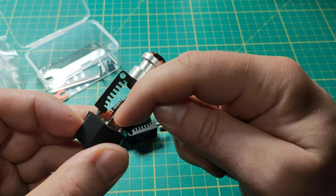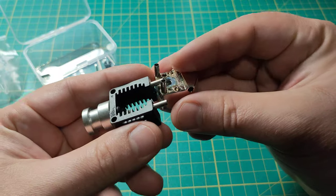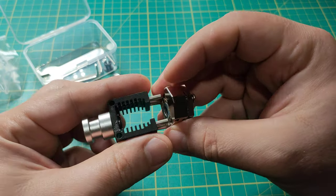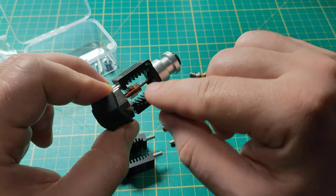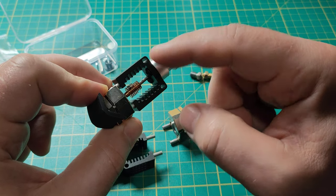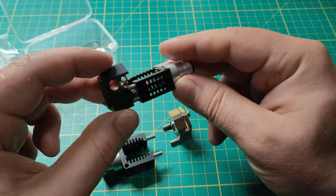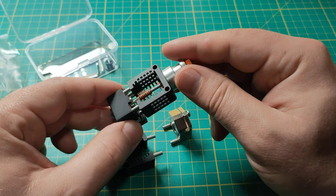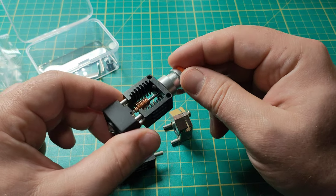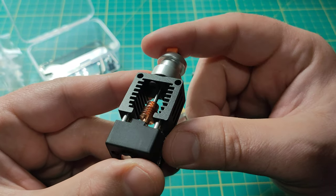There is no big problem to take the PLA out, but then I disassembled all of this hotend and I found out those pipes are very thin. This tube — this throat — what goes inside here, I just squeezed it because it was so thin. It is very thin, not very robust. That's not a thing for me because I like robust things where, if I grab it with pliers or something, it's not gonna be squeezed or squashed.